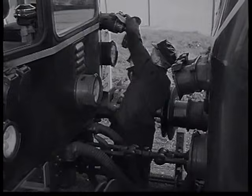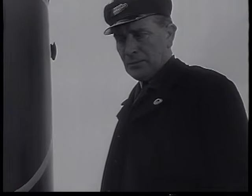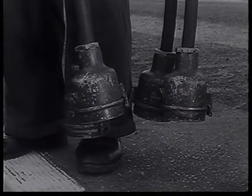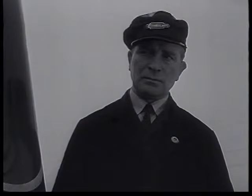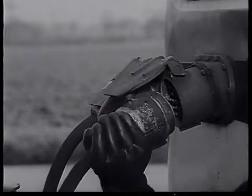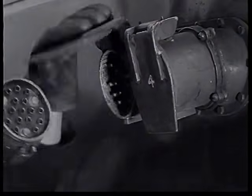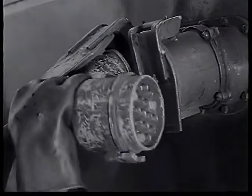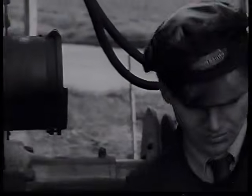On each side of each train, there are two connector boxes mounted side by side to receive the sockets on the ends of the jumper cables. Care must be taken to keep the contacts dry and free from dirt and damage. The cables are fitted parallel to each other, but it is difficult to connect them wrongly because the casing of the sockets and plugs are molded differently. There is a male and female molding provided, as you can see here. It is essential that the cables are pushed home properly and that all 8 safety clips are firmly secured.